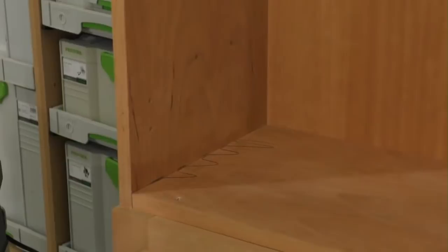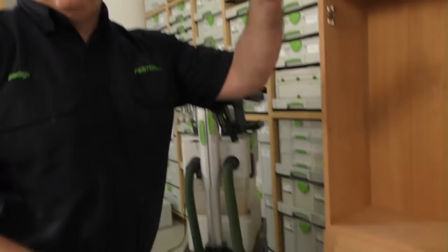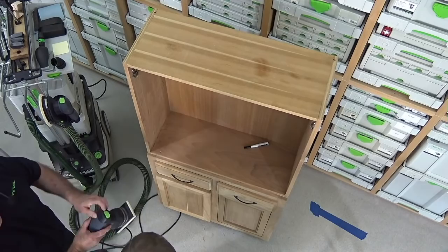One thing you should always do, and let's talk about Festool sanding. I have it all the way up here like this. That kind of sticks. But if I turn it down, it starts to float. So I always turn that down. It helps eliminate one of the things that causes swirl marks. If I take this pad and bring it up against that adjacent surface, that's marring the adjacent surface. Follow? And it's bumping around.